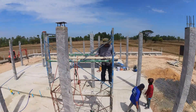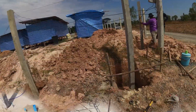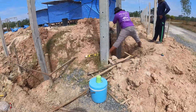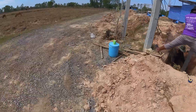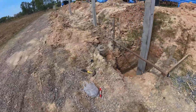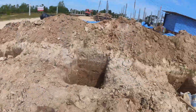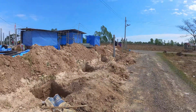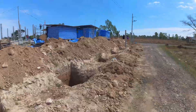The plates get set on top of every pole, measured from the mark up, and then the steel lays across to make basically the foundation for the roof structure. The fence team is setting the poles — they'll run them all the way down and put the beam in all at one time. They'll bury them, tie into their footing, then put the steel in to make the beam. Wait — they're missing five poles. One, two, three, four — the boss man will probably bring the other five later.